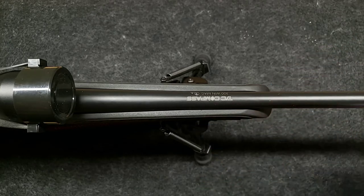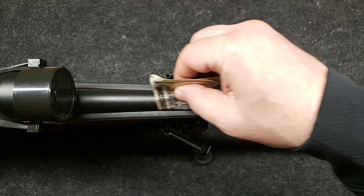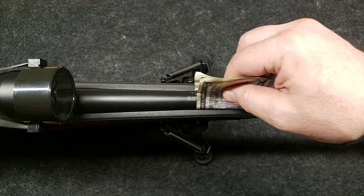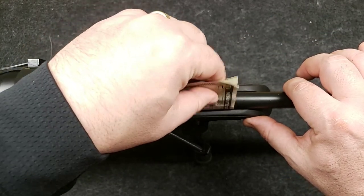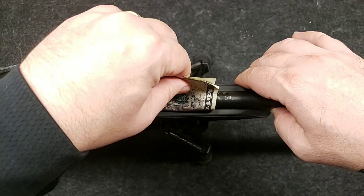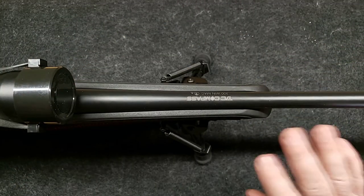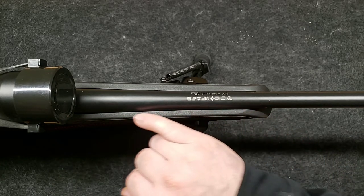First of all, on this forehand here, this gun is supposed to be free floated. We'll just take a bill here — a lot of people use one bill — and we'll go through here. You can see it's free floated, but it's hitting something down there, just barely. If you put any pressure on this thing, even a quarter of a pound, in either direction it's stuck. That means if I put any pressure on the bipod, it's not going to be free floated anymore. What we need to do is inlet this a little bit more here on the stock.